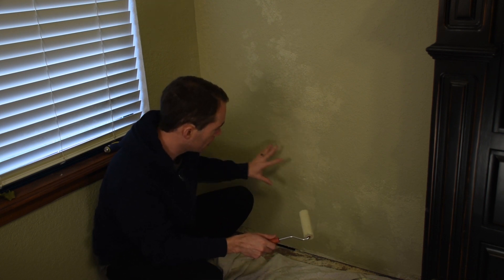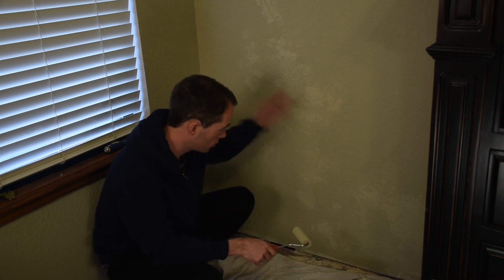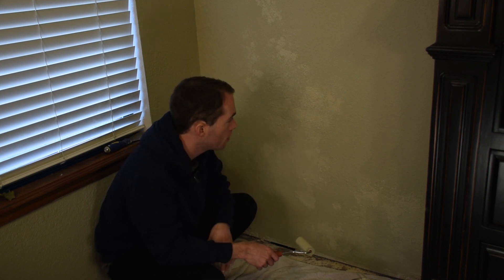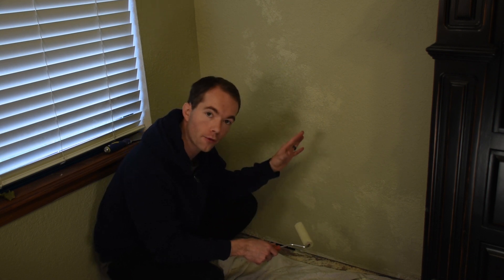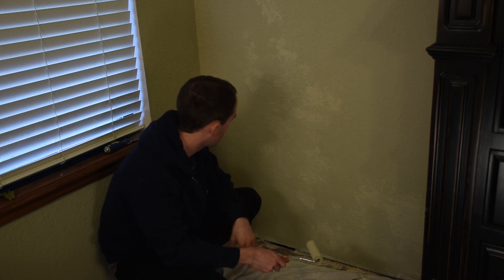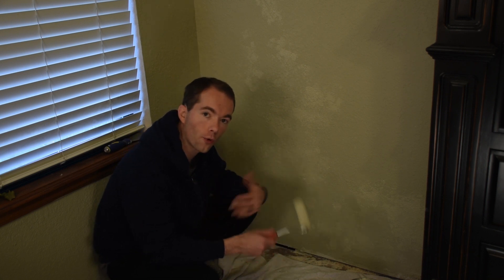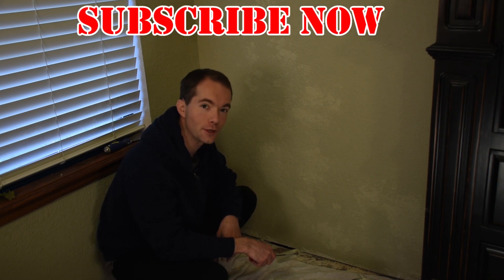If you don't have one of those texture guns, don't worry about it. If you're going to do something a little bit like this, just buy the orange peel in a can. Or you can even just slap it on by hand and do it that way. It's not absolutely critical to shoot orange peel first — sometimes I don't, depending on the size. If it's a really large size texture, I don't even bother shooting it; I'll just go ahead and slap it on and do it all by hand. As you can see, it's really not all that difficult to fix a wall. There are other ways and orders of operations you could do, but for this project, this is what I did and it worked out pretty well. I'm Mike Thompson — thanks for watching, I really appreciate it.